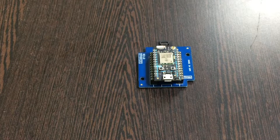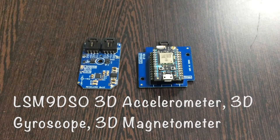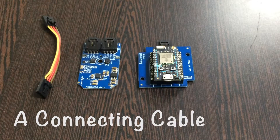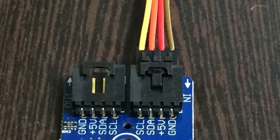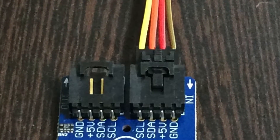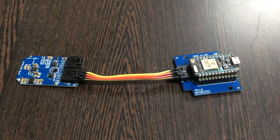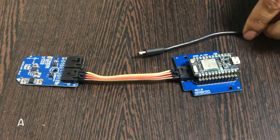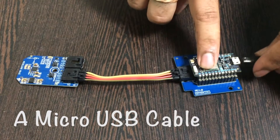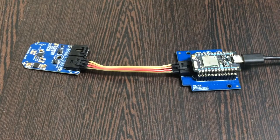The next part we require is our sensor, the LSM9DS0, and here comes a connecting cable. Make the connection of the cable to the sensor, and make sure that the brown wire of the cable is connected to the ground terminal of the sensor and to the I2C shield. The last part is to provide power, and for that we require a micro USB cable — gently insert it into the power jack. We are now done with the hardware section.